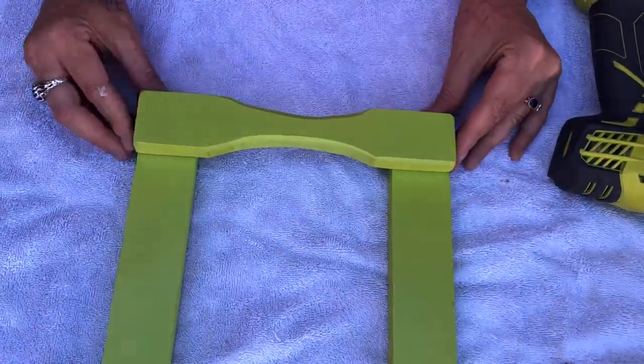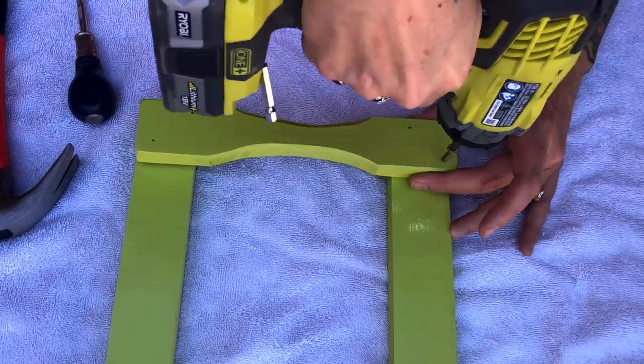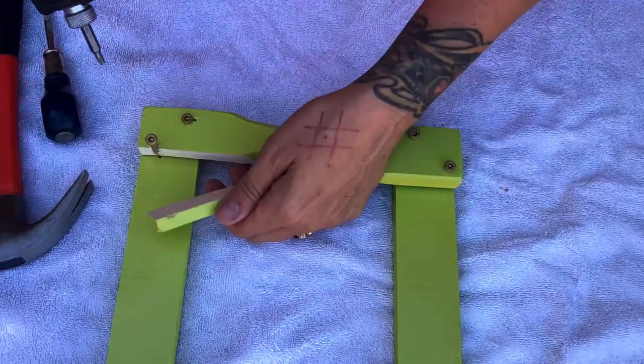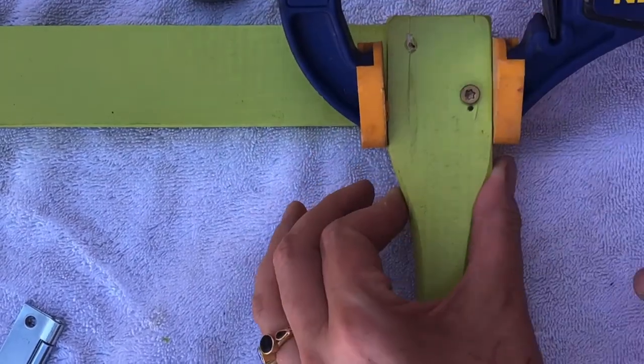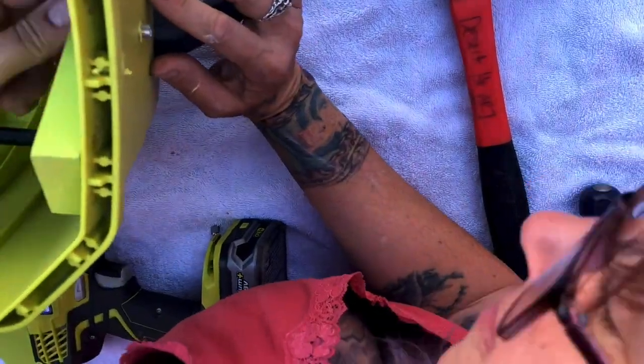This was one of those days where I just struggled with the project — time-lapse video and editing hides a lot of mistakes. But the main thing I learned was that I should have drilled pilot holes for all the screws. Then I wouldn't have split the wood down the grain with the screws in two places.